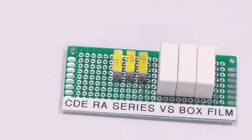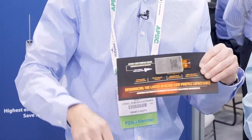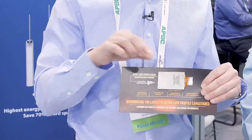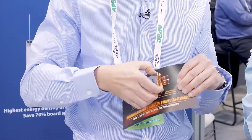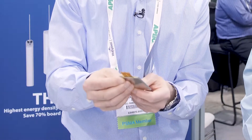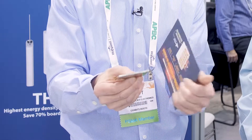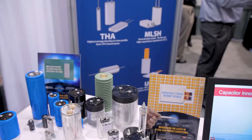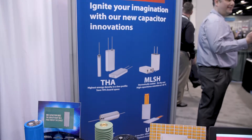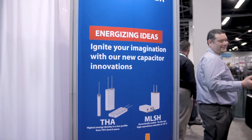As another example of how we're solving some problems in packaging, here's another electrolytic capacitor which we're targeting as a replacement for banks of solid tantalum capacitors. This is an aluminum electrolytic technology. It's actually 3 millimeters thin. We have a 2 millimeter version, but a capacitor like this has 4,400 microfarads at 35 volts DC. If you worked out the equivalent solid tantalum capacitors, it would be roughly two or three times the board space to equal this one component. So again, we're excited about being able to help engineers solve their space, weight, and even cost problems.